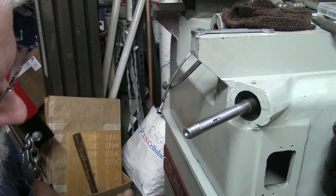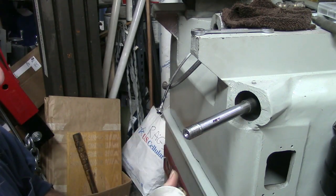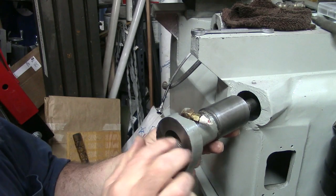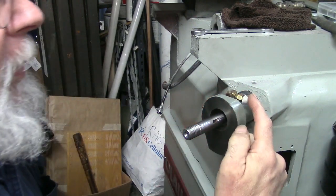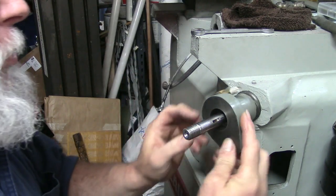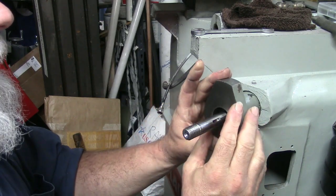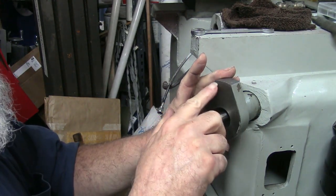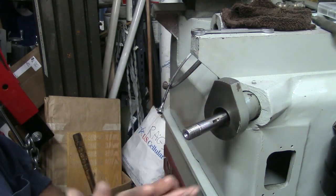So there'll be a stack of bearings on this side and a stack of bearings on this side. And this also has a bushing as well as thrust bearings and an oil fitting. This is oiled from the pressure oiler. And so this will have to be set, as well as the pressure on the thrust bearings and the clearance between the wheel and these 2/10 graduations on this wheel here.